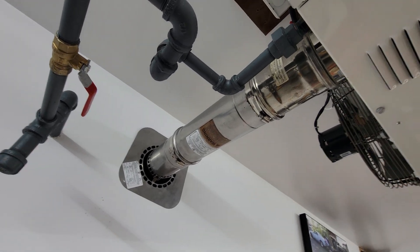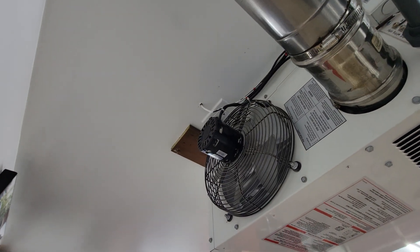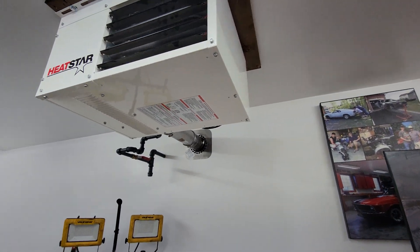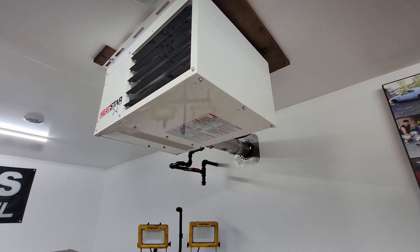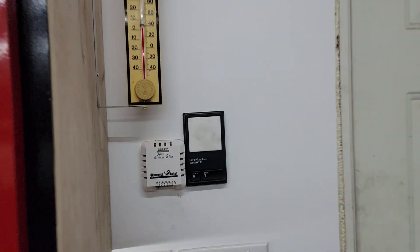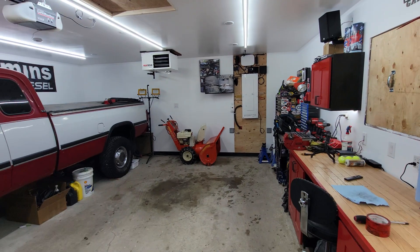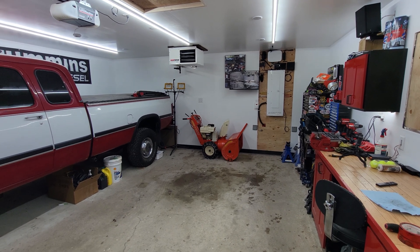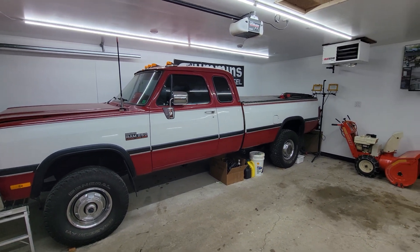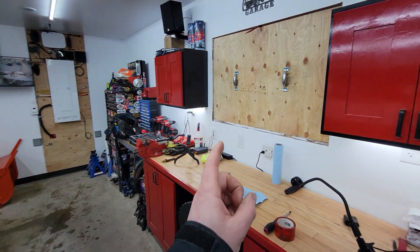They did another swing joint outside before the line goes into the ground, and the same on the other end at the house. I wired an outlet up there for the heater unit — so it has gas, electricity, and an exhaust vent. It heats the garage nicely. I have a thermostat right here and I keep it above zero to make sure nothing freezes and equipment doesn't see too-cold temperatures.